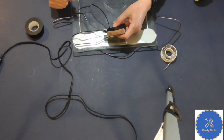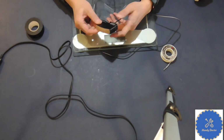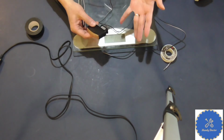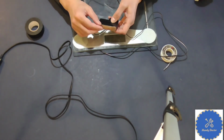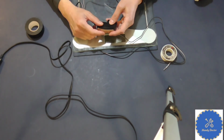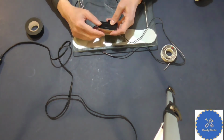My recommendation is that typically you don't want to make it a permanent installation if your voltage is a lot different from what it's supposed to be. As you can see, it's 3 volts versus 5. Does it work? Definitely, but I want to unplug it all the time. That's why I put a reminder for my family. And so far, they have done perfectly. They would rather do it this way compared to being out of battery all the time. Okay, so keep that in mind. Unplug it when you don't use it.